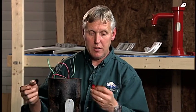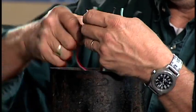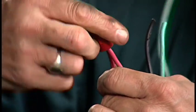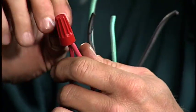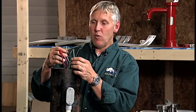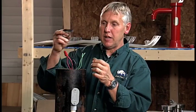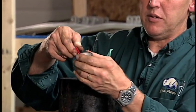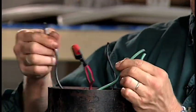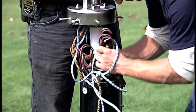If you're not comfortable with the heat shrink method, you can simply wire nut the wires together. I would recommend that you squirt some clear silicone and fill the end of that wire nut with silicone. Put the two red wires together, put your wire nut over the top, and tighten it securely — the silicone gives you a good watertight connection on that wire nut. This is probably the easiest way to reconnect these wires and is perfectly fine. Once you have all three wire nuts connected — red, green, and black — take some black electrical tape and wrap each wire connection. This gives you one more bit of assurance of a tight connection. Now your wires are reconnected, stuff them back down inside the casing, and you're ready to begin the installation of your deep well hand pump.